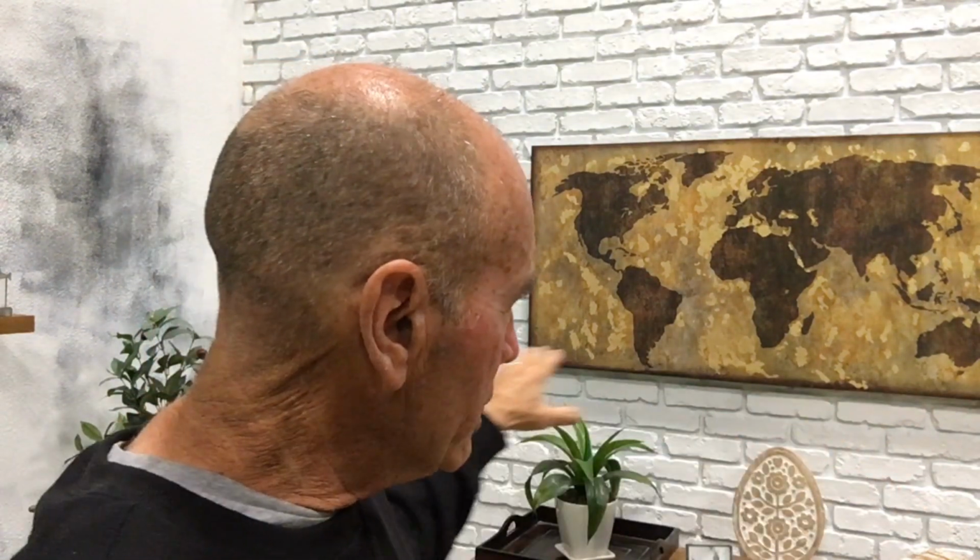Now, the one complaint I have about this product is that some of the seams do show a little bit more than I'd like them to. The vertical seams were fine because we staggered them and we caulked them and they looked great. However, the horizontal seams just didn't fit together like they should have. We did some stuff to make it work out right, but it shouldn't be that way. They're pretty expensive panels and for the price, should fit together perfectly.